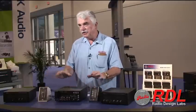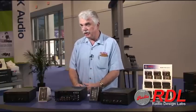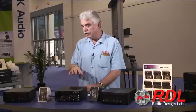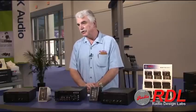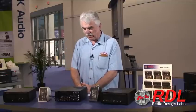These are our green series of amplifiers and we use the term green because they do meet the Department of Energy's standards for efficiency, for idle power consumption and for standby power consumption. All of these models have internal supervisory processors that monitor the usage of the product and shut down unused portions of the electronics to generate the absolute maximum amount of power savings possible in any mixer amplifier.